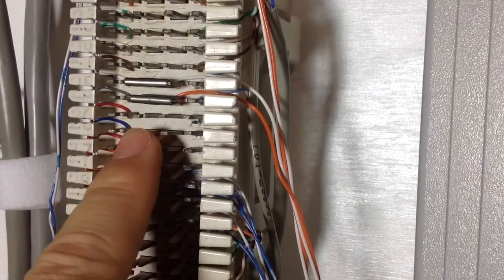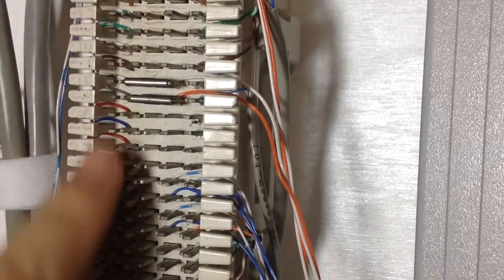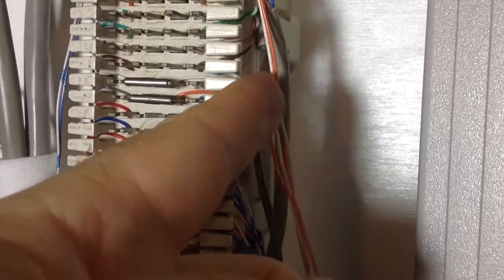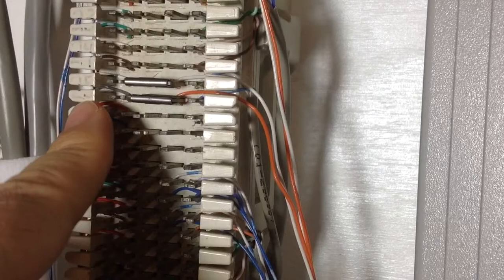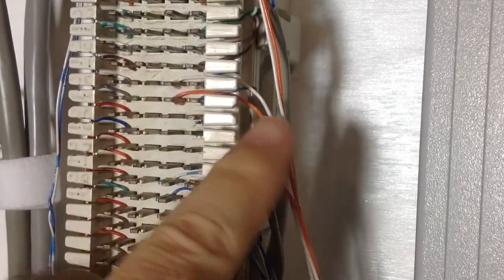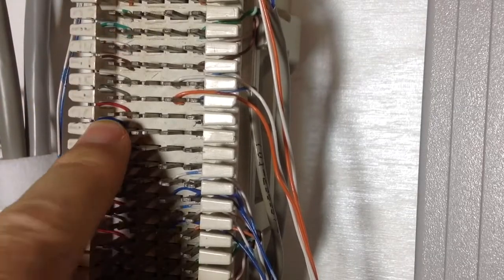So why would you want to use this? Well, there's a few reasons. One reason is that oftentimes when you're installing, say for instance, a phone system, or if this was a phone company DMARC, services or hot circuits are on the left hand side. And then you make these cross connect wires or jumper wires to the right hand side, and then you put the bridge clips in between the two. So what this creates is a removable demarcation point where you can say, okay, if I take these off, I know that all the stuff on this side is disconnected from the hot circuit, whether that be a phone line or a phone port coming from the PBX.